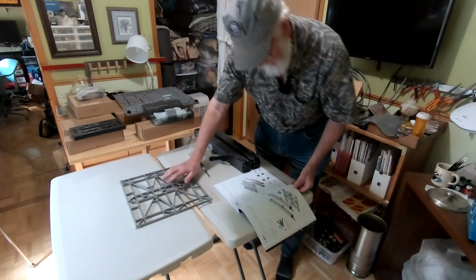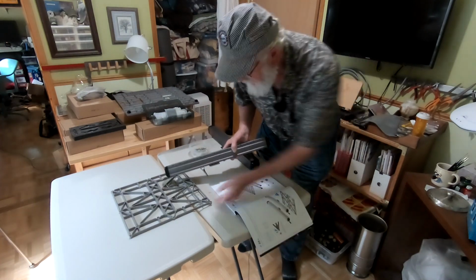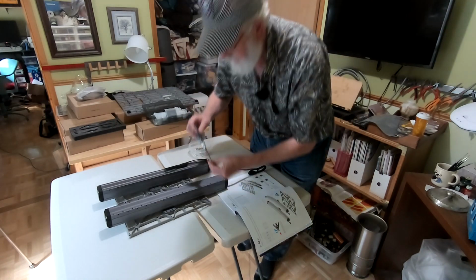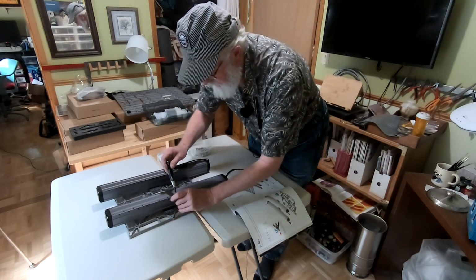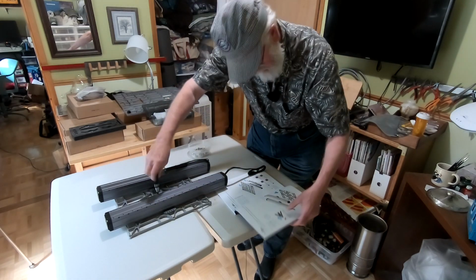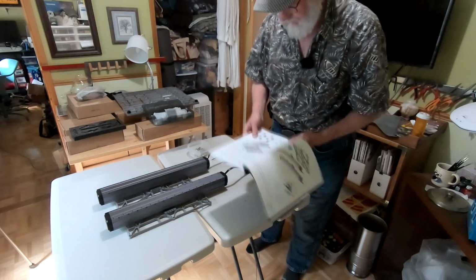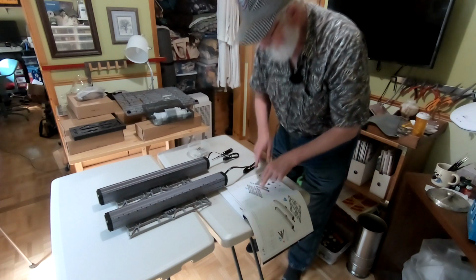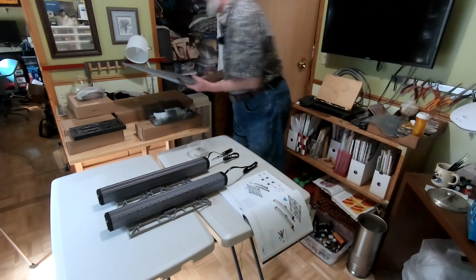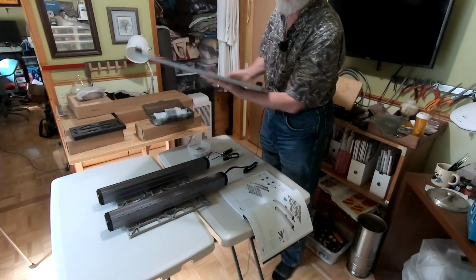Okay, now we have the platform. That's the base, this is the platform. Okay. And we've got a lot of these screws to put in. Here, we only need 8 for each of these. Okay, and we do not tighten these yet. Just run down to where they're just touching. Okay, now we get to do twice as many. Now we take the base plate. There's 2.